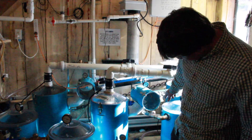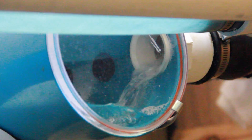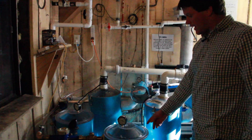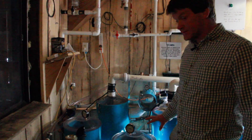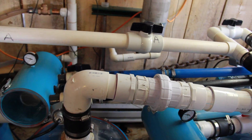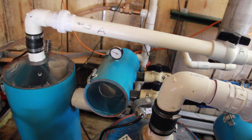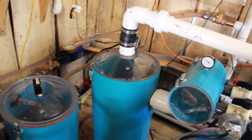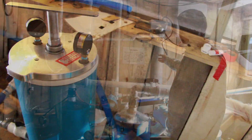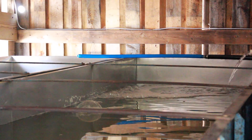The sap flows into this little canister — you can see it flowing right in. When it gets high enough, there's a float switch, and there it goes. We just got enough sap to come in, it raised up, the float kicked on a pump, and now the pump is pumping all the sap out of these canisters through a totaling meter. Each of our systems is set up to a meter that logs every gallon of sap we collect, then it goes through ultraviolet light.